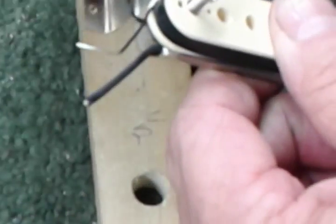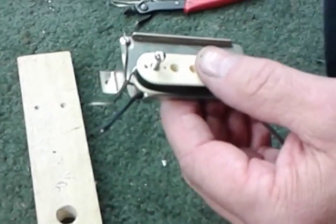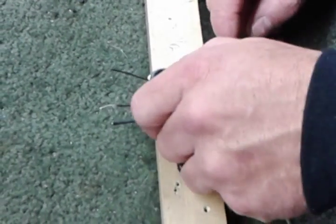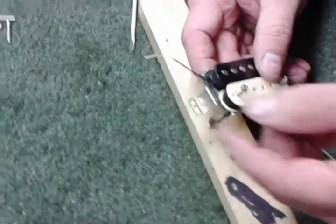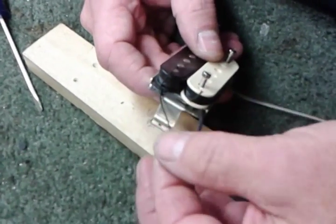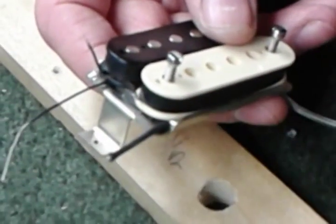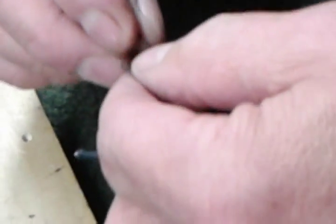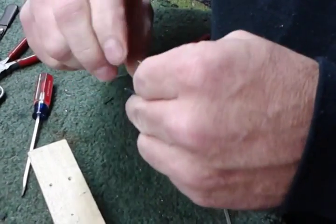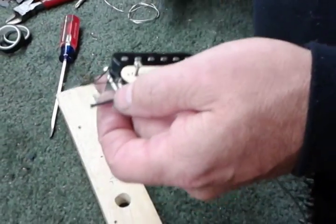Now that we have that done, you have room to tuck that back down in there. Now it comes time to mount the screw bobbin. We've got the slug bobbin mounted and the pickup's put together. Now we're going to do our final connections. We really have two connections left to do: the two finished leads, which is also called the series lead, and the hot lead off the slug coil, which is the start lead. That's going to go to our cotton-coated lead wire here.